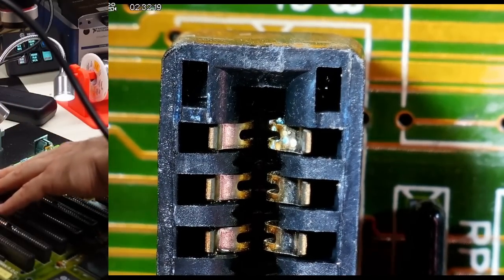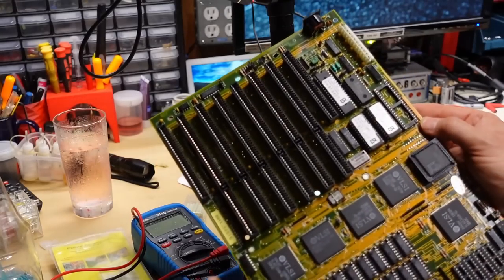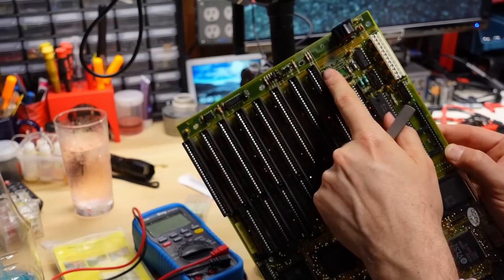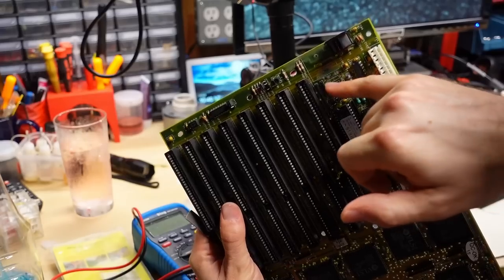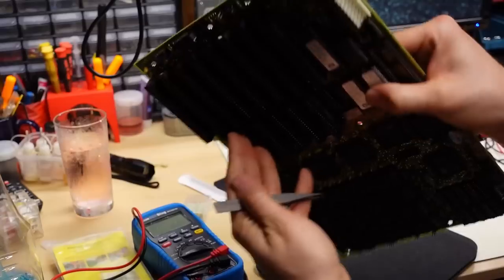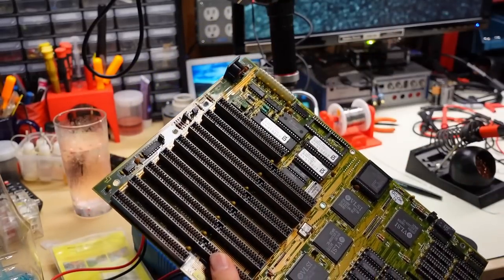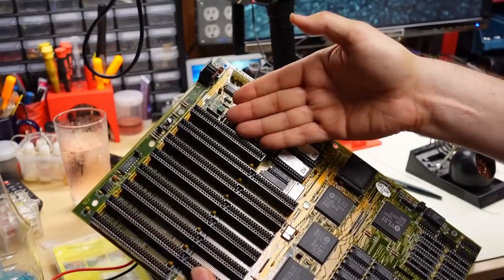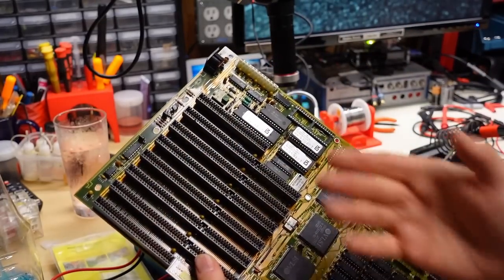I just noticed there's actually a little bit of corrosion inside this 8-bit slot right there. What's kind of amazing is the corrosion was able to crawl up the slot, especially because I don't see any corrosion down at the bottom. Luckily you can still buy these connectors, so if I was really wanting to save that slot, I could replace it. Ultimately, even if that slot goes bad, you still have seven other slots that work.